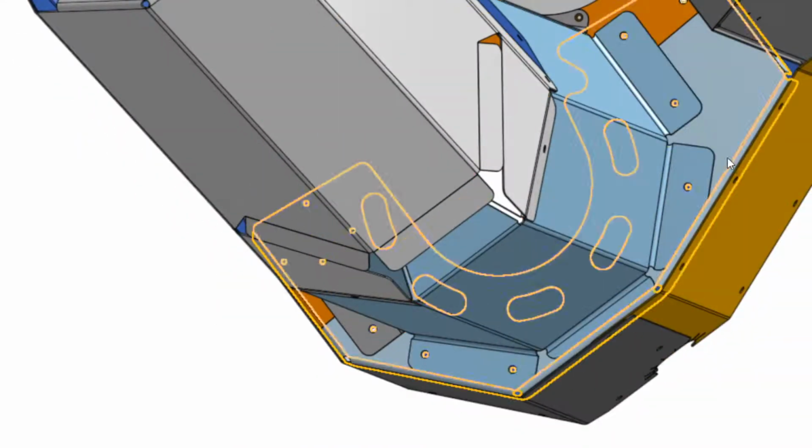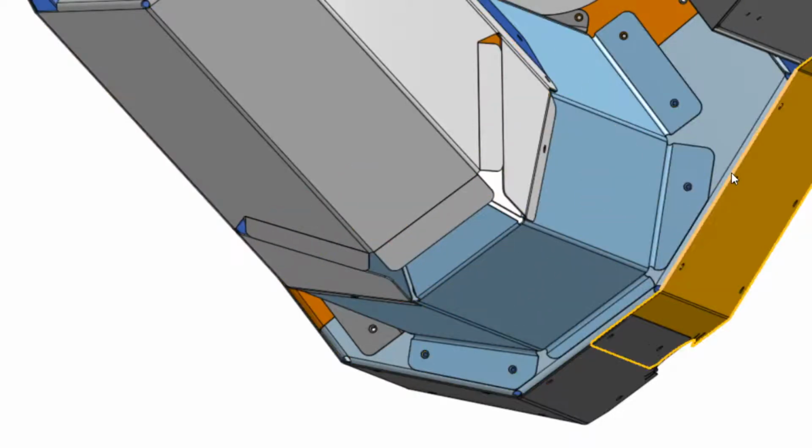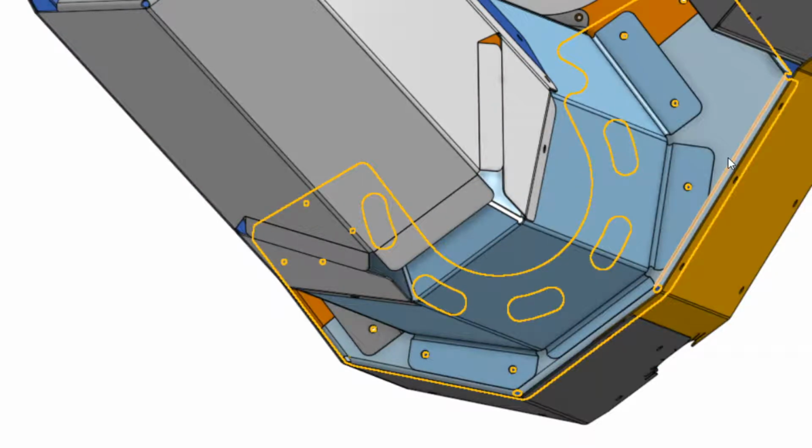Here's that piece. You can see that it has a semicircular cutout here, and that will wrap underneath the exhaust pipe where the exhaust pipe is narrowest. It's about 3.5 inches, and it should fit around that. There should be enough clearance. If you need to trim it, you can, but you shouldn't have to if the measurements are correct and they made the machines consistently.